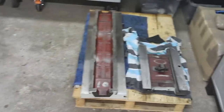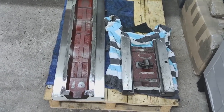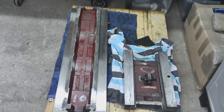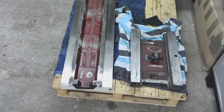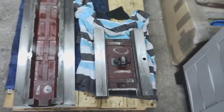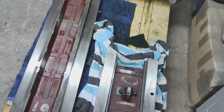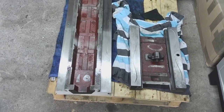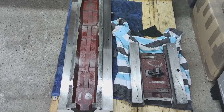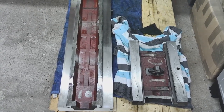The X-axis and the carriage for the Y-axis — those are all done, completely cleaned up. Slideways stoned. Every edge has had a file over it to put a sort of half-millimetre chamfer on everywhere. The feed nut for the X-axis has had the same brush treatment with the Dremel. That looks more like what I'd expect a brand new machine to look like that's just been built. I've done some checks on these as best I can, just with some straight edges and things like that, and it's actually all in quite good condition. I'm very hopeful that when it gets put back together it's going to make a good machine.